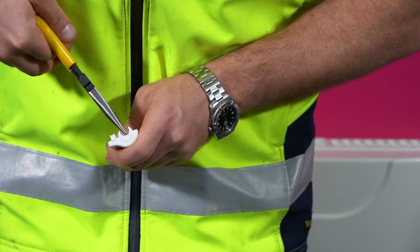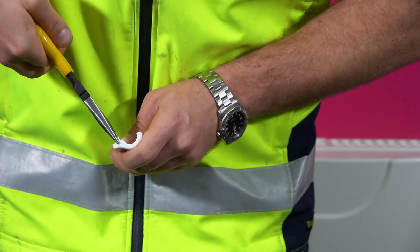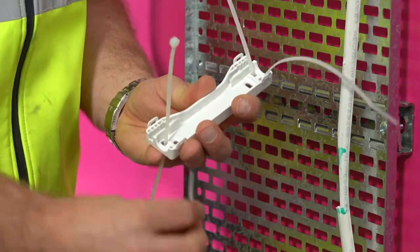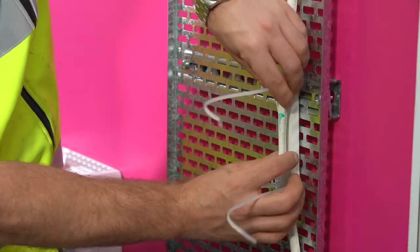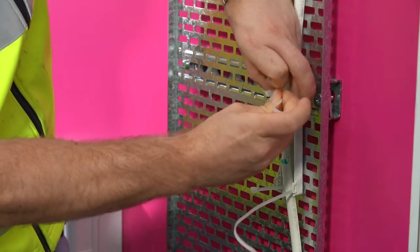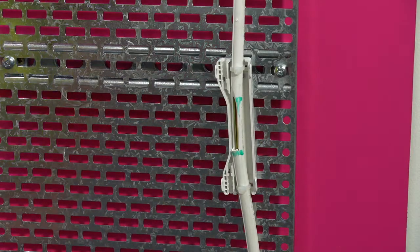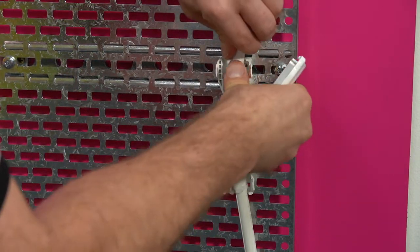If the Vertikasa cable diameter is greater than 9mm, the larger cable tabs will also need to be removed. Feed two cable ties through the breakout unit so it can be tied to the cable. Align the breakout unit centrally over the window and tighten the cable ties. Adjust the position of the cable ties if necessary and place the cover on.